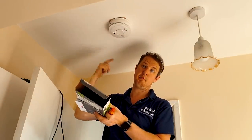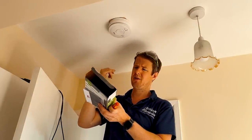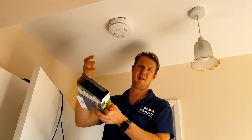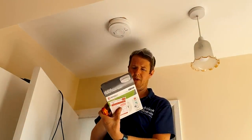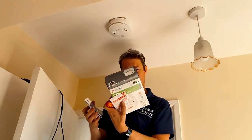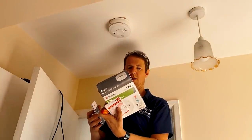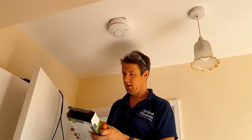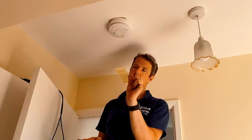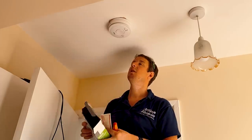These also have the AudioLink feature. You get the app on your phone, press the button in a certain sequence, and the phone listens to the beeping sequence and tells you the health of the alarm — how long it's been active, how many times it's gone off. It's a bit of a gimmick probably, but quite cool. Once you've changed one, you're supposed to put a sticker on the consumer unit with the fitting date and a red sticker to identify which circuit it's on.